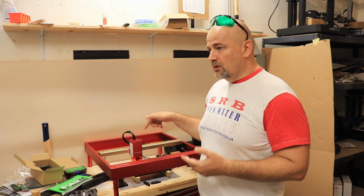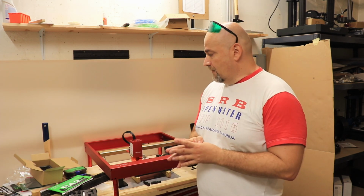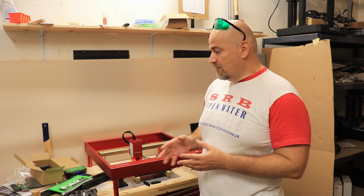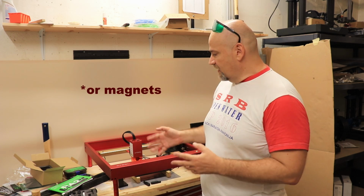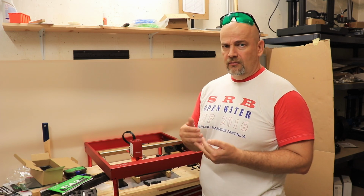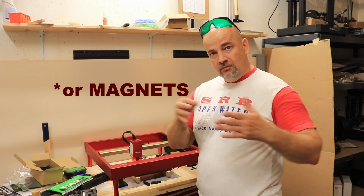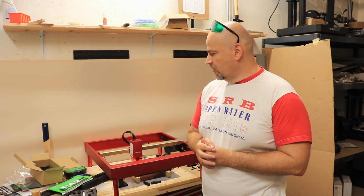About the RA2 Pro rotary attachment, well, this is definitely a very versatile product, but it's a little bit complicated. So if you want to change it, you need to do some assembling using some bolts. So maybe there is some space for improvement to have some clips or something like that. So replacing the chuck or moving the cylinders, we don't have to unscrew the small bolts. Pay attention, don't lose them because they are very small. But with some kind of clip or pin, it can be moved much faster. Small thing, but well, there is small space for improvement.